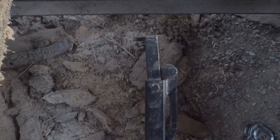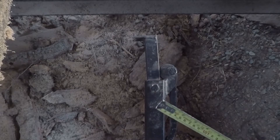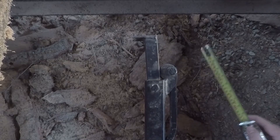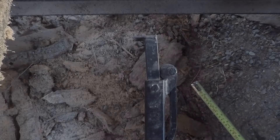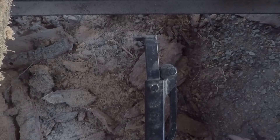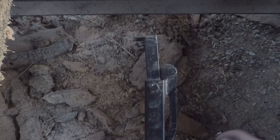I'm pretty happy with how the log dogs turned out. I wanted a quick-release style — I didn't want to crank in with a screw or anything. So this is what I came up with. We've got inch-and-a-half HSS, one-inch square stock, some quarter-inch flat bar by one inch, some half-inch square stock, and then some half-inch thick plate that I cut into the shape of a cam, along with quarter-inch thick sidebars out of one-inch flat bar.